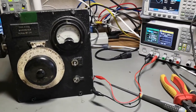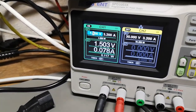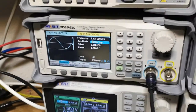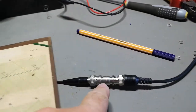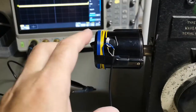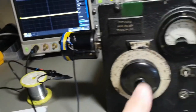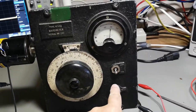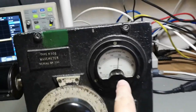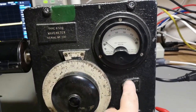So the tube is in, we've got 1.5 volts connected, and this is the filament supply drawing 78 milliamps. I didn't turn on the signal generator yet. The cable from the signal generator goes to some random windings on the coil. I also got a scope nearby just to see what is going on. A funny thing I found: 'test' measures the battery voltage - so that's all there is to it. 1.5 volts is here - nice to know.